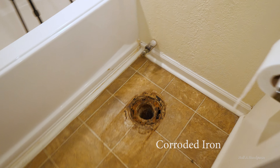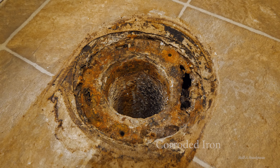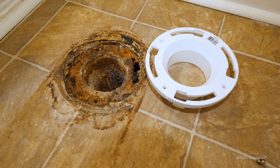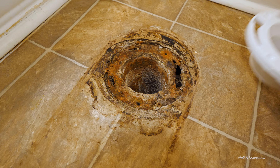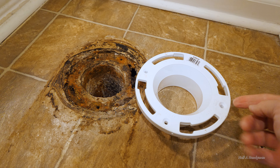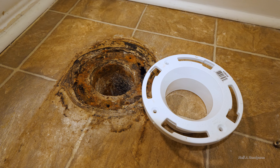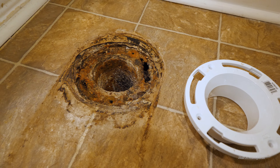So this here is an old steel flange — it's not in the best of shape. What was here was a piece of PVC flange like this; I had to cut it out with a sawzall. I'm going to have to place this brand new one in here because the other one was broken around this. When the stud was on there, it could easily move, so if somebody was to sit on the toilet, the toilet would go back and forth. So I'm going to put this in here and attempt to find somewhere to anchor.